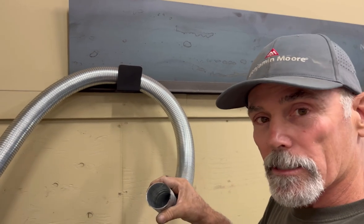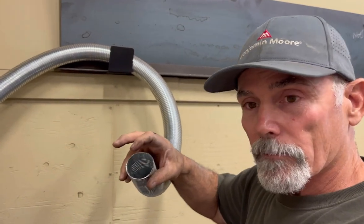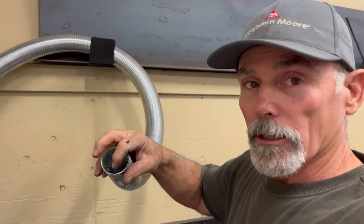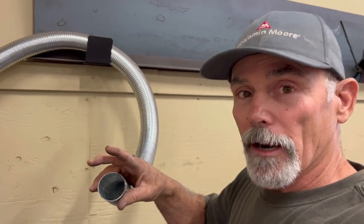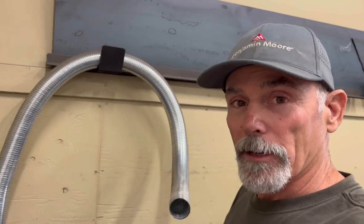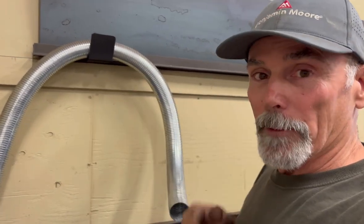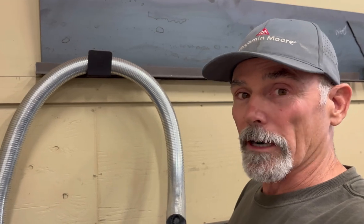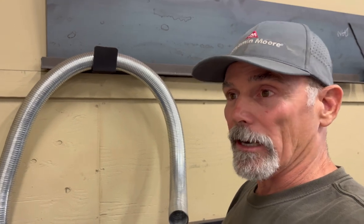I went down and got some of this flexi stuff here and just put the collector pipe in here and then bent it around to get a shape of it. Then I was real careful taking it off, took the pieces to an exhaust shop and had them bend me a couple of pipes. I really didn't want this kind of pipe running to my exhaust, so I wanted a nice, good hard pipe, and that's how I could get it without this thing running and without having to take it to an exhaust shop.